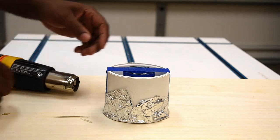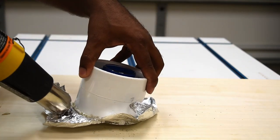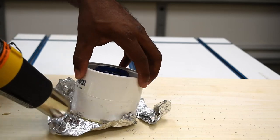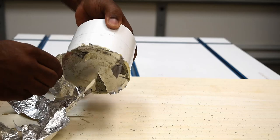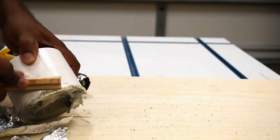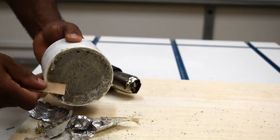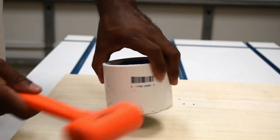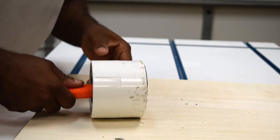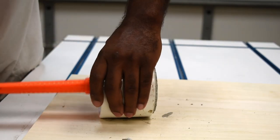Now let's remove the aluminum foil by peeling it off. I'm also going to use the heat gun to soften up the glue around the perimeter so I can remove all of it from the form. Anything we can remove from the form helps prevent the concrete from bonding to the PVC coupler. Next, I'll use the heat gun once more to slightly soften the PVC, then take the mallet and pound the outside to loosen the concrete and create some separation.